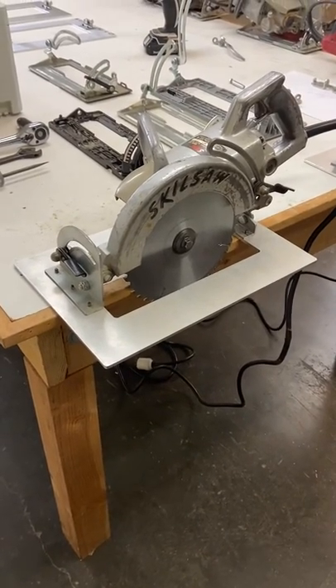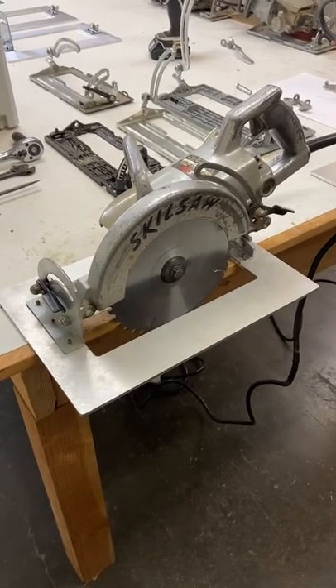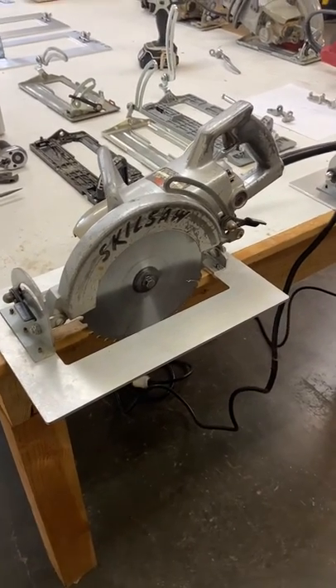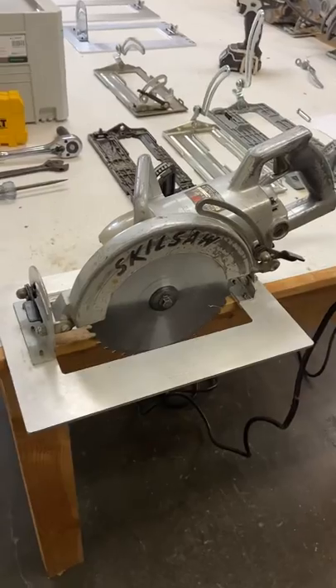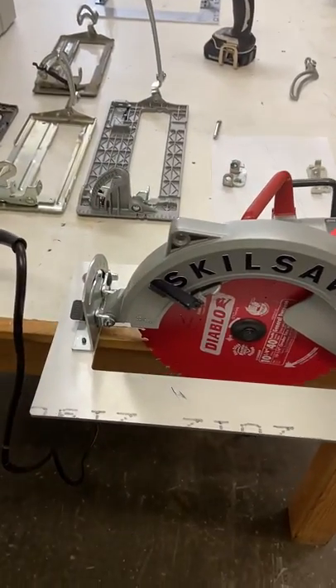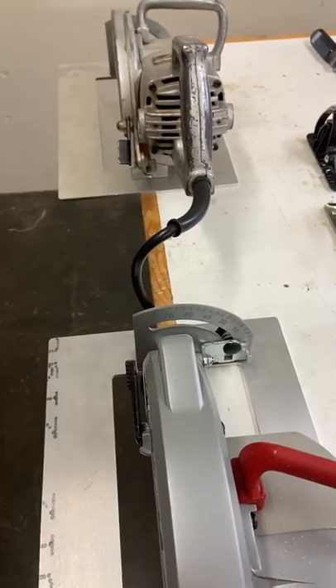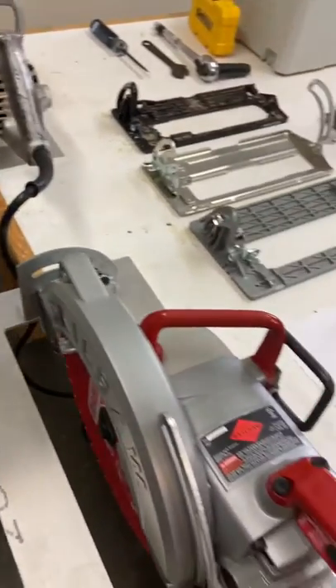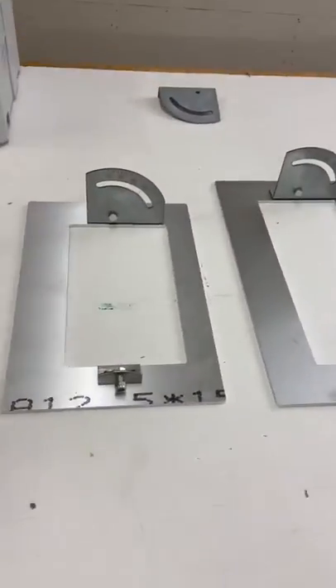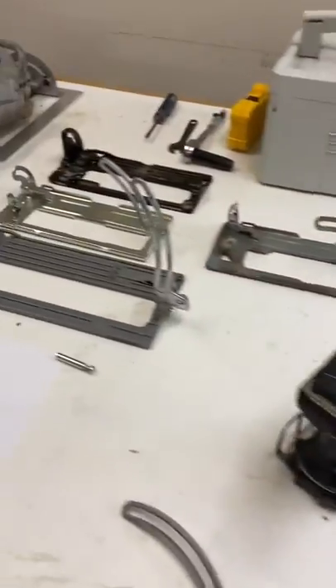What you're looking at here is a quarter-inch thick aircraft aluminum swing table on an eight-and-a-quarter skill saw, but it also fits on a seven-and-a-quarter skill saw. This is an elongated version that fits a 10-inch skill saw, allowing you to swing past 45 degrees for seat cuts when gang cutting rafters. Here's how they look when they're ordered — different prices.